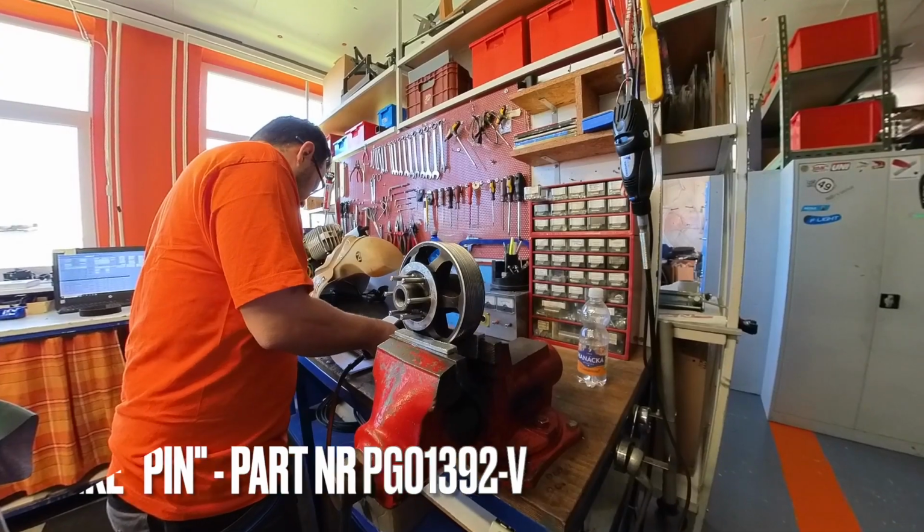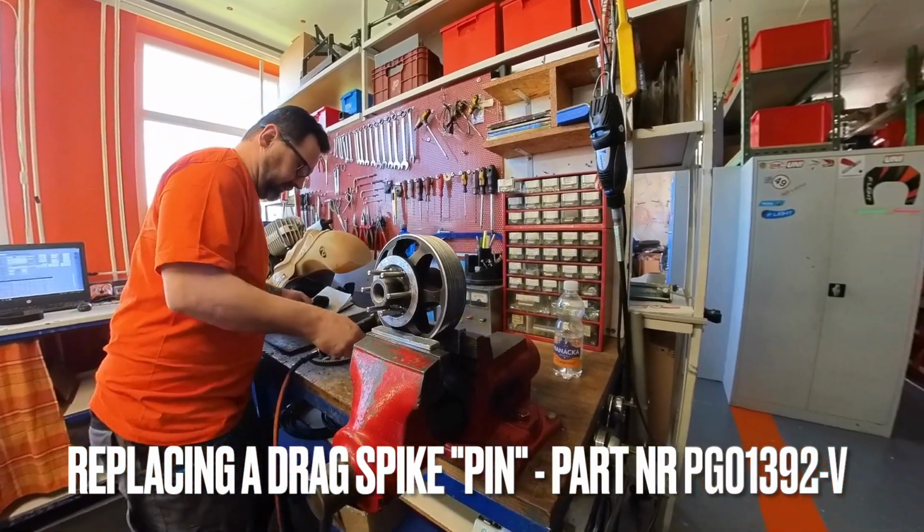If that displays signs of a lot of soil, dust, rubbish that is just clogged up, or gummed up, I can call it that, with grease, then you know that that's failed. That bearing is losing its lubrication, it's not doing its job, and you replace it.